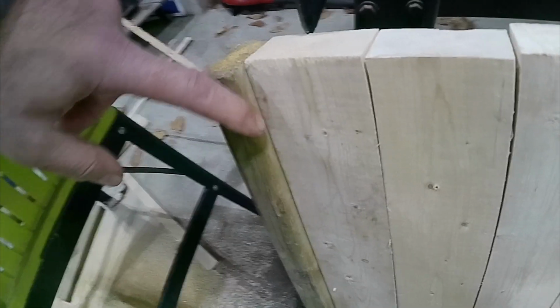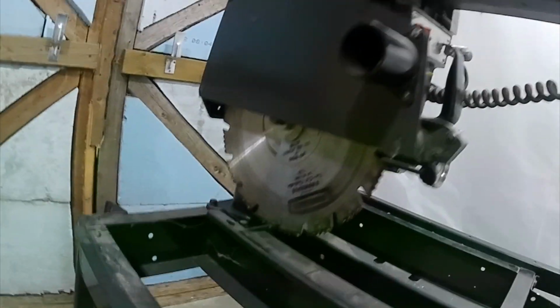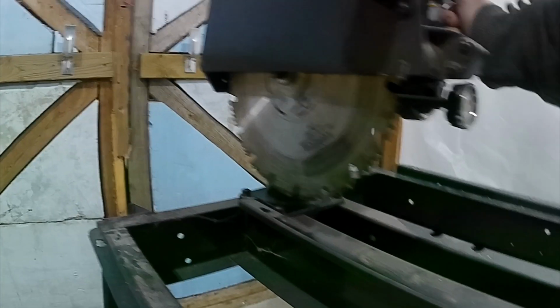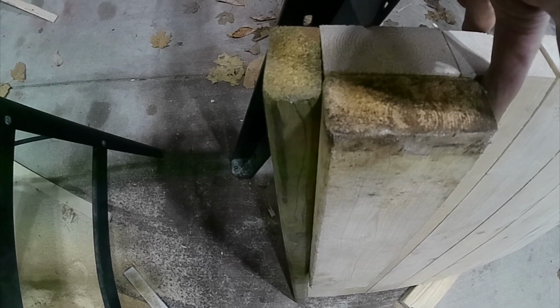And also I put a little bit taller one in the back that I'll show you later. You kind of want a square edge back there, so you put a slightly taller piece, because when your saw comes back, it can hit that. It should stop right behind it, but sometimes it hits that. It'll give you a square edge when the saw goes back. If you want to put a board in there, it's just a backstop, to stop stuff from flying off the saw. But you don't want it super tall because the saw can come back.